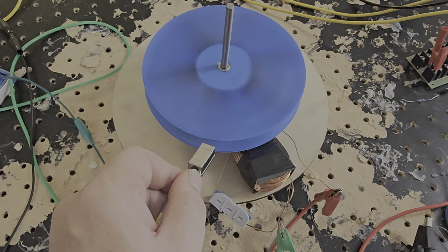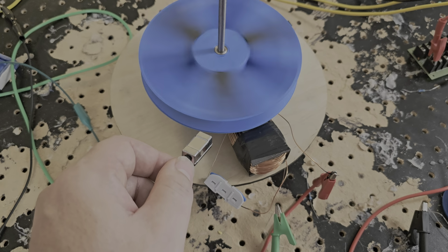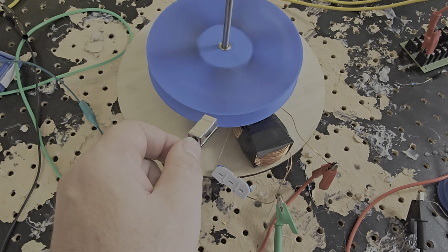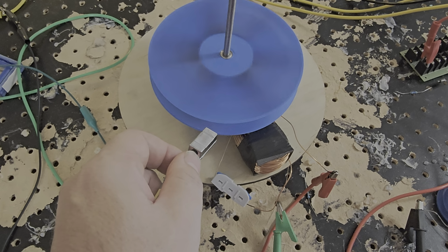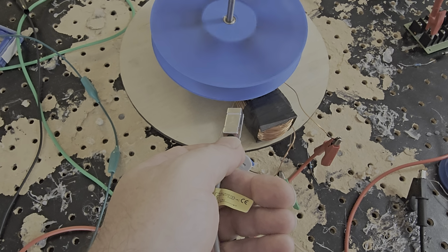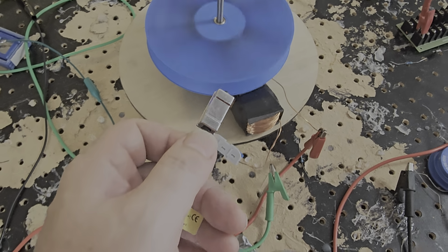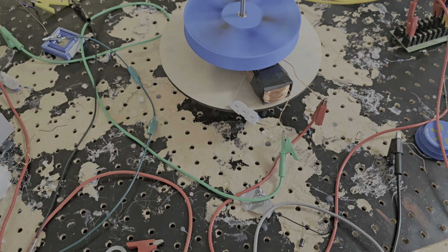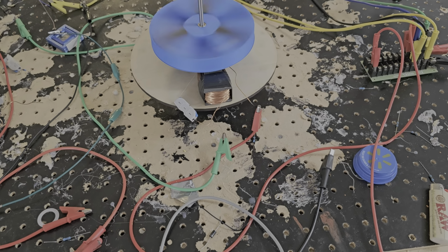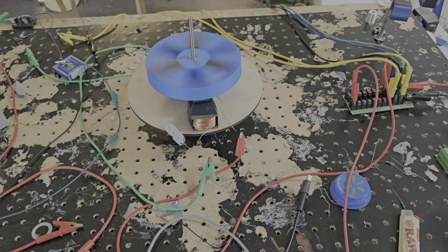Alright, so really what I'm doing is just testing to see if the coil works. And it works pretty good. I probably won't do the double, trigger strand wrapped in there. Probably just do the 20. And then either make a separate trigger coil or use a reed switch like I've been doing, and a transistor. So I think the reed switch and the transistor is a good way to go.